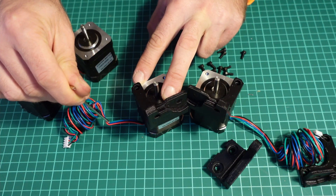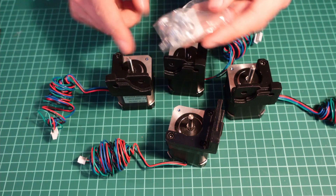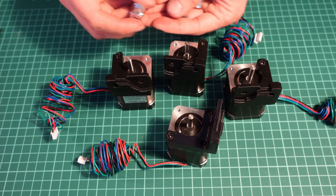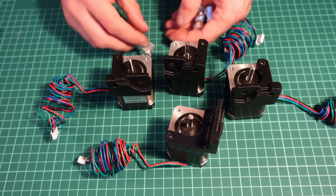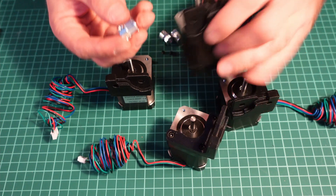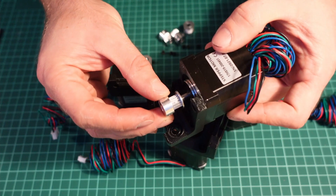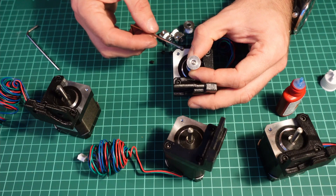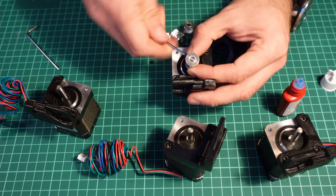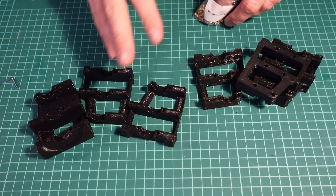When you're done with the motor mounts, you should install the pulleys on the shaft of your motors. These are 16T GT2 pulleys. The manual requires applying some thread locking compound while installing them. The manual also says the locking part should be on top of the shaft. I usually start by installing the grub screw that goes against the flat of the motor shaft, then add the other grub screws to stabilize it.